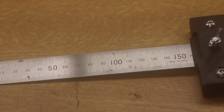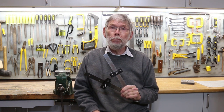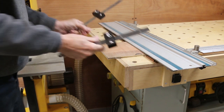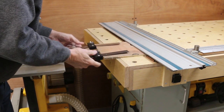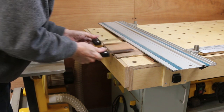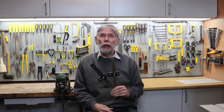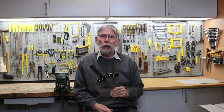Positioning the dimensions is very clear and simple. With two of these, even hard to arrange parts are easy — set your dimensions on the gauge, fit them to the wood and push it in until it touches. Dead easy. T-bar gauges are useful in their own right, but when they're combined with a waste side jig, what's not to like? Can I actually call this the ultimate waste side jig? That's all for this time — see you next time.